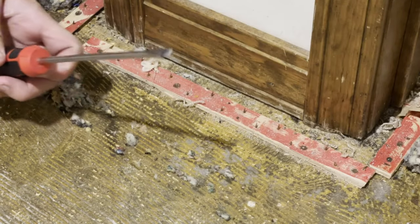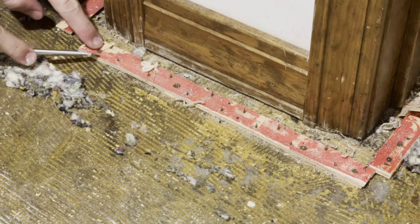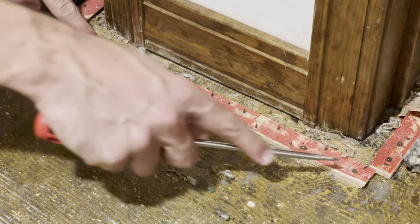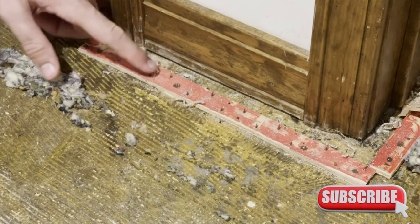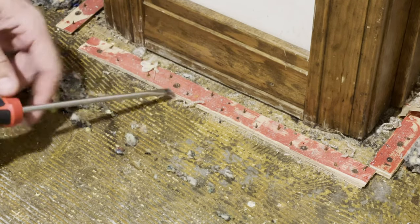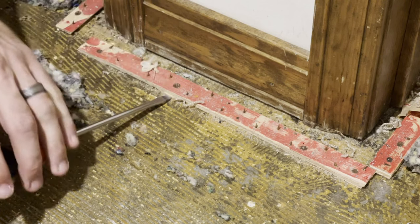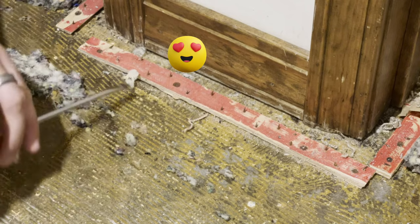Using your screwdriver and your hammer, you can locate the tops of the bigger nails that have been driven down into the concrete. Be careful because these tack strip pieces are sharp — they're meant to grab the carpet. Use your flathead screwdriver, placing it on the ground at the base of where the nail is, and just tap it in until you see it start to lift off.